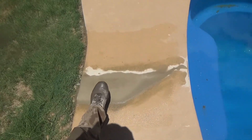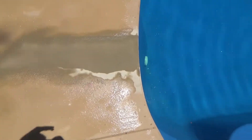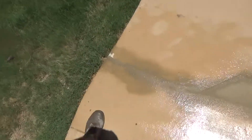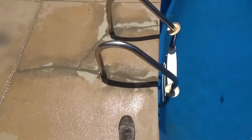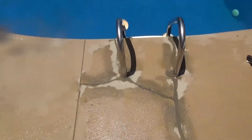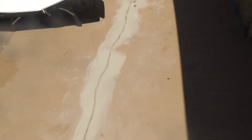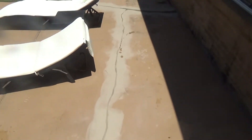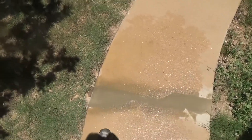I got those two spots, this crack done, and this crack done. I got this area that I floated out — a lot smoother transition, about 12 inches wide right here, and another 12 inches wide or so that comes out through there and then fixes back in where we did the crack. There was a real bad area right through here so we got it filled in up through there. You can see the dark color of it, but when it dries it lightens up — and that color matches in pretty good with the brown.